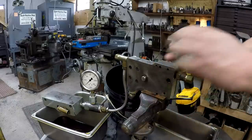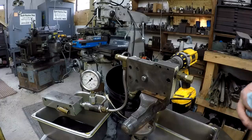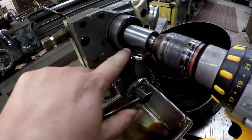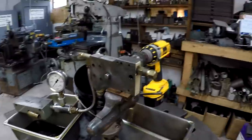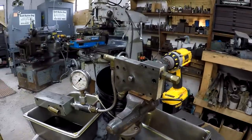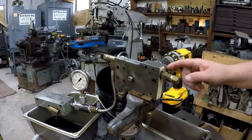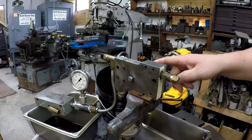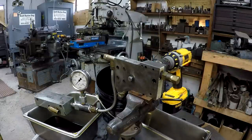These are just two machine plates that are bolted together, so it's not completely sealed. And you got the pan underneath here because the oil comes through your bearing area, okay? Now, one other note that I'll point out is this setup right here is not completely concentric with that shaft. The shaft's not bent. It's the chuck, and it's how this is set screwed down on that shaft right there.